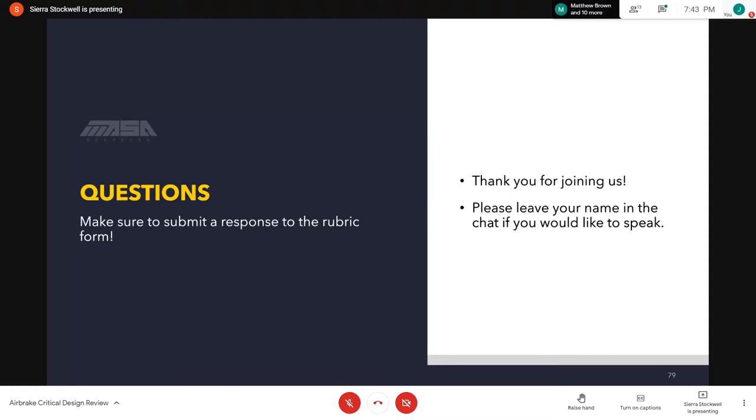If you can, we have small vibration tables at the university that you can work with the professor to run this motor with the encoder through a vibration profile, and you can observe when things stop working. Then you can see if there are some design mitigations you can do, like dampening of the system with rubber washers, or a digital approach, or maybe you figure out a proper dampening system. I also wonder if we could check the frequency at which it's turning, because if we set the motor to a certain RPM, the encoder should also give pulses back at that set RPM. That could be another solution I just thought of. But thank you for bringing up the vibration table. I'll have to look back into that if I ever get a chance to go back to the university or we ever get any of this ordered.